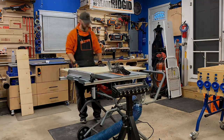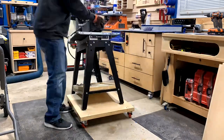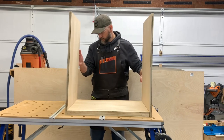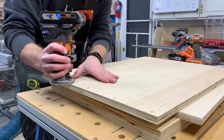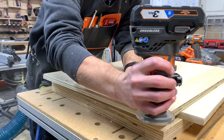I'd made a simple rolling platform for the old base and planned to use it for the new cabinet. I pre-drilled the side panels so that I could screw them into the existing base platform. I also added a quarter-inch round-over on all the bottom edges so that boots or brooms couldn't get caught or rip the veneer of the plywood.